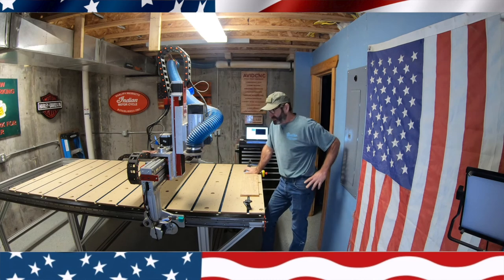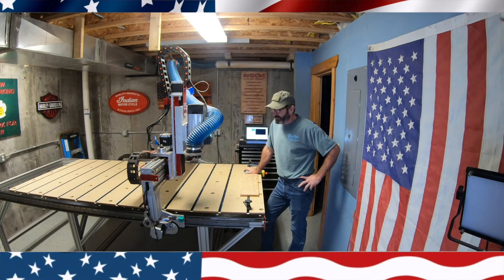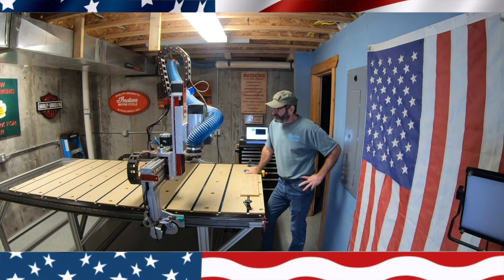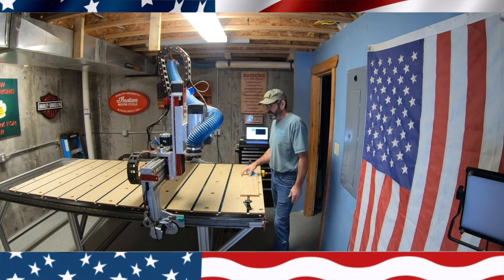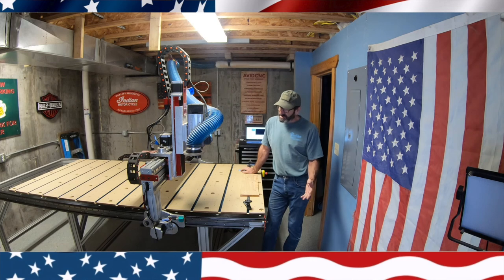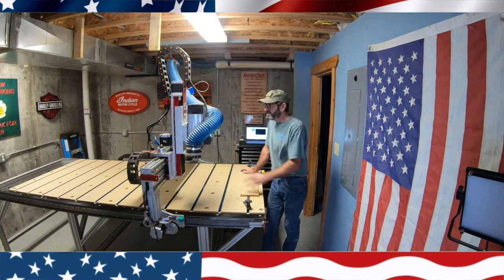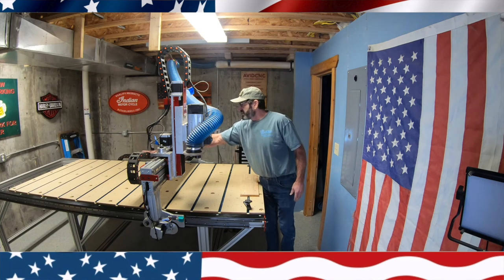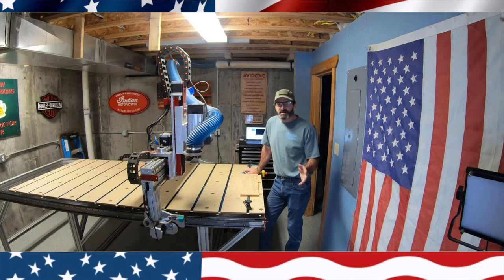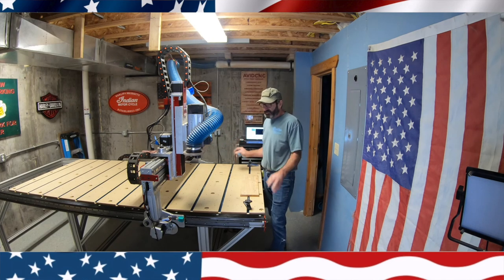And that's about it. So every three to six months, depending on how much you use your machine — I tend to use mine at least five out of seven days a week and usually do one or two projects each day, whether it's cutting boards or other projects — maintenance is pretty easy. Every three to six months you just grease up your things, clean your rails, check your belts, and go over everything. I'll also take Allen wrenches and go around to verify that everything is tight.